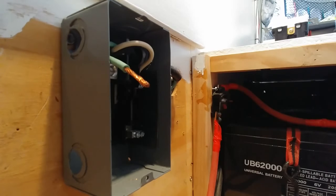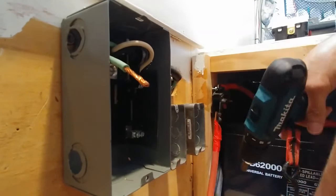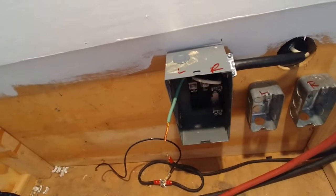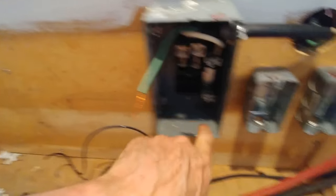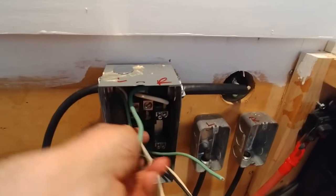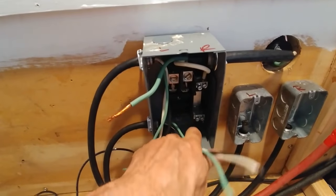We're going to have some 12-3 stranded wire that goes in the sides here and here to the breakers, and they're going to loop around to the two boxes for the 110 outlets. Here are the two boxes and the two outlets. The left breaker side goes to the left box, and the right breaker side goes to the right box. We need lesser gauge wire for a 20-amp than for a 30-amp: 30-amp needs 10-gauge, 20-amp only needs 12-gauge — higher number but smaller wire. I've put in clamps here, here, here, and up here — two on this side and two on the bottom. I've got green, white, and black 12-gauge wire for each circuit.